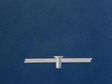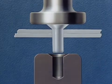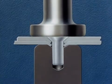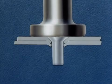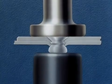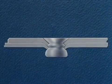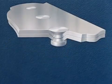The driver uses a standard flush rivet set. The bucker uses a special dimpling set that has been adjusted by the tool department to give the correct angle and depth of the dimple. Using the rivet as a punch, we dimple the two sheets together into the dimpling set. The special dimpling set is removed, and the driver retains the standard flush driving set. The work then proceeds with the bucker using an ordinary bucking bar. Driving this type of rivet requires greater skill than the previous method. Any clenching or offset of the rivet will cause the dimpled edge to crack — the rivet must be driven straight. We have just shown the double-dimple method of riveting, used when both sheets total forty thousandths or less in thickness.